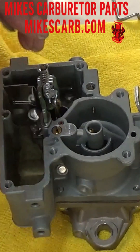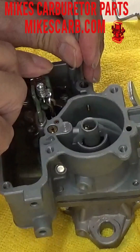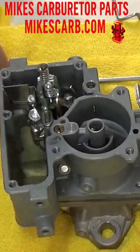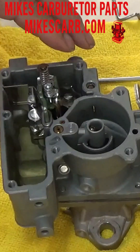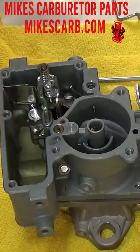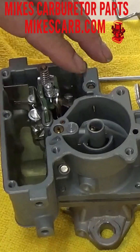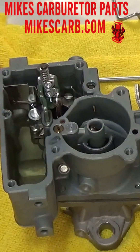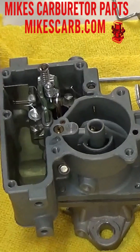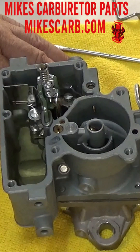The other thing you want to do is hold down the check weight and pump it. You shouldn't see much of any gas or mineral spirits coming through. If you do, tap on it lightly a few times — that'll help seat either the ball or the check weight. Some have a ball and a check weight; some have just a check weight with a pointed end that takes the place of the ball. Tapping a few times will help seat it.